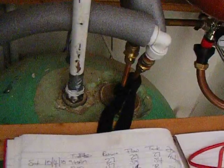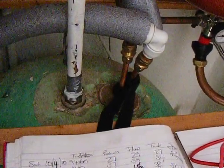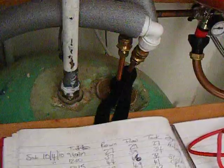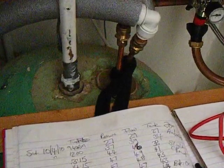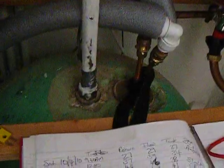I didn't have an immersion heater, so it's using the immersion heater boss on top of the cylinder. The actual heat exchanger itself was an eBay purchase — £70. A guy in Sudbury in Suffolk makes them. It's 10mm pipe — I think he said something like 15 metres of pipe, coiled up, just screwed into the top of the immersion heater boss.